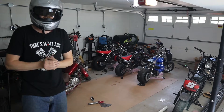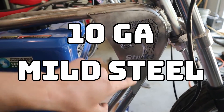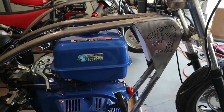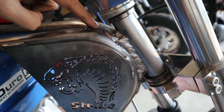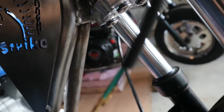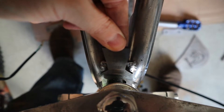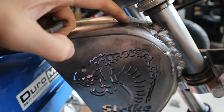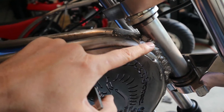I have my custom gussets fit and I'm going to be mounting them on the sides, going to be doing a one and a half inch weld here, one and a half inch weld here and here, just going to be giving it a little bit of rigidity. This is a pretty thick frame so it doesn't need it too much — this gusset is going to be for show. I take two of these wishbone pieces, one for the top and one for the bottom, slip them down and bend them into place to conform to the frame. I'll weld them up and this is going to be my top and bottom for a rigid neck support — weld the top on, weld just the joint of the neck, weld the bottom on, then weld over the top on a secondary layer.